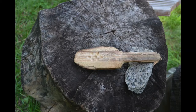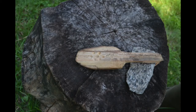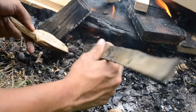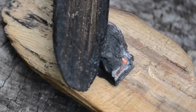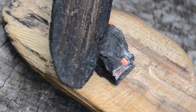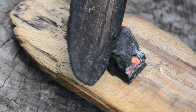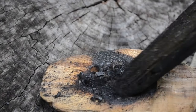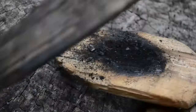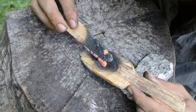So I've drilled seven shallow holes in a hex pattern. I should have drilled more, but I broke three drill bits from lack of experience, so I got frustrated and moved on. Now I'm scooping up an ember from my fire over top of the drilled holes, just holding it in place with a stick and blowing on it. Blowing on it will make the ember burn hotter and keep it alive, otherwise it'll just go out. Once the ember goes out I take it away and assess the damage, scraping away any charred sections to speed up the burn. Then I rinse and repeat until the burn has reached the required depth.